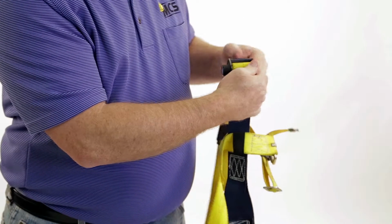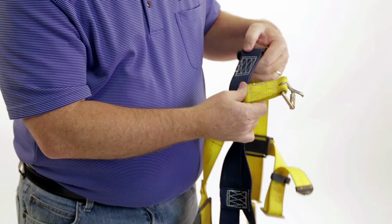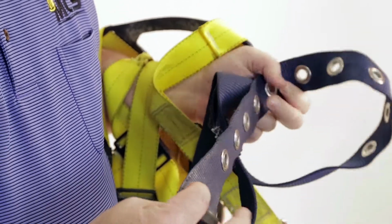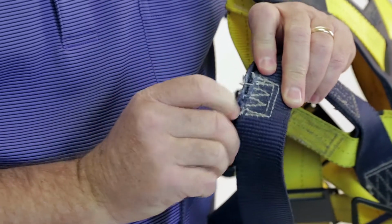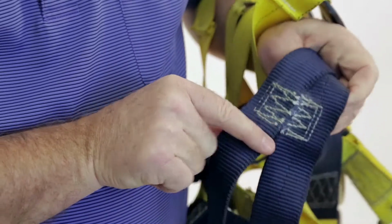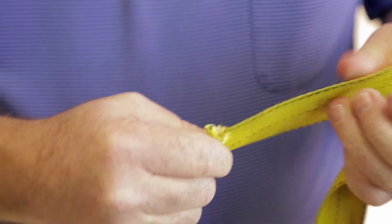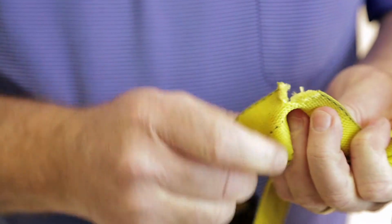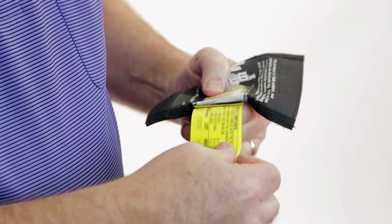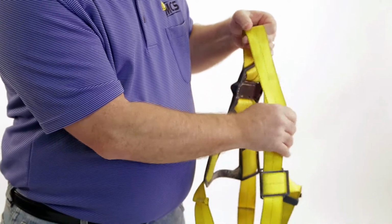Harnesses should be visually inspected prior to every use. Ensure buckles work smoothly. If present, inspect the quick connect buckles by ensuring that the release tabs work freely and that a click is heard when the buckle engages. Webbing material must be free of frayed, cut, or broken fibers. Check for tears, abrasions, mold, burns, or discoloration. Check for pulled or cut stitches. Broken stitches may be an indication that the harness has been impact loaded and must be removed from service. All labels should be present and fully legible. If inspection reveals a defective condition, remove unit from service immediately and destroy.